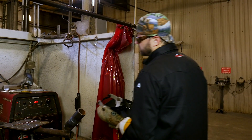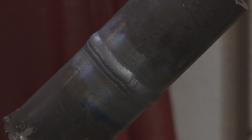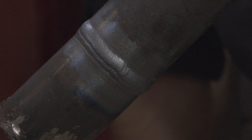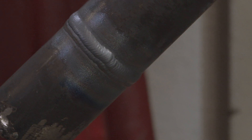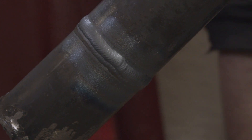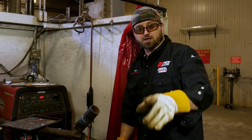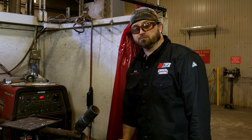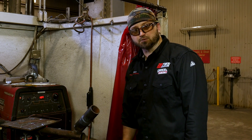And now we have welded out our 6G 2-inch TIG all the way out schedule 40, all with a 70S-6 wire. We've got a nice pretty bead on there. Like I say, it's easy to be done with just a little time and practice. You can make these welds too and go out and make that big money. Thanks for watching. Looking forward to hearing your comments and feedback. If you need some help please contact us at Tulsa Welding School. Thank you very much, have a great day.